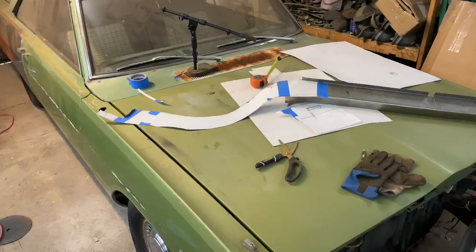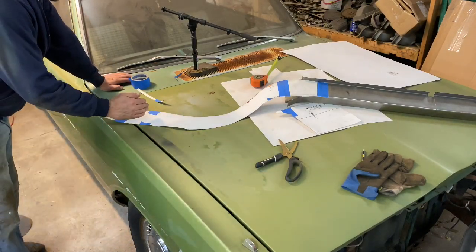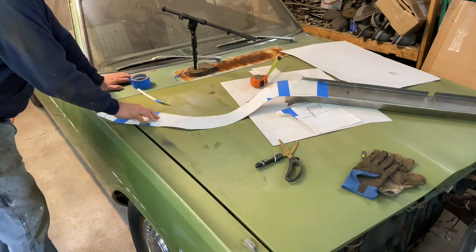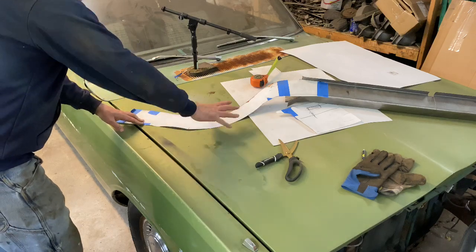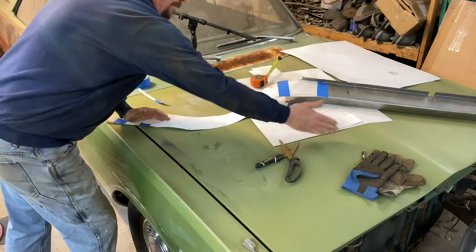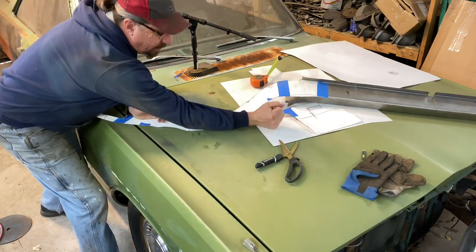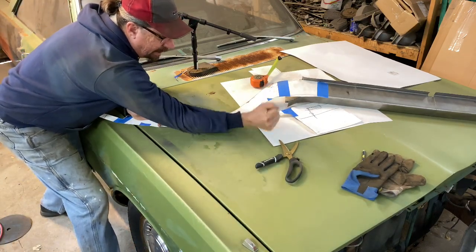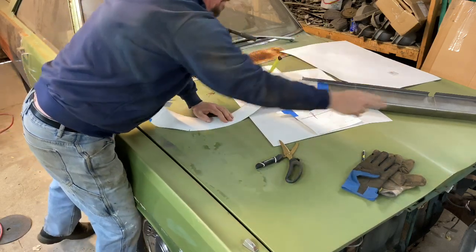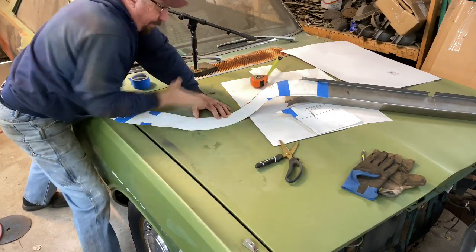So as I mentioned, where the spring mounts, the front of the spring is right in here-ish. Let's say it's right here-ish. So this is on a Mopar where all of the torque is up on the suspension, right here, right? So on a Mopar, the front half of the leaf spring is completely stiff. It's not sprung, it's just there. It flexes a little bit, but it pretty much does this. It does not flex in the middle. So all of the spring is in the back. So when you launch your Mopar, all of the up force is right here in this frame, right?